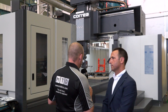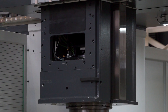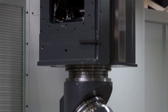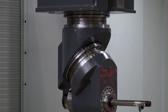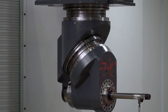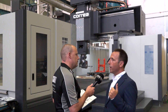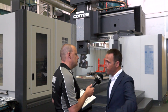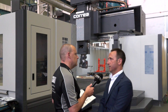And what about the heads on these machines? What are my options? We have all kinds of heads — starting from the vertical exit just for heavy cutting, but also we have indexing universal heads, all combinations of 45 degrees or 90 degrees at 6,000 rpm. We also have finishing heads, full five-axis. We also have angular heads and we can install turning heads as well.